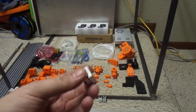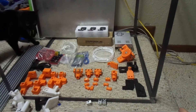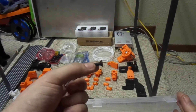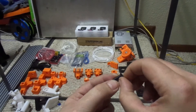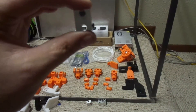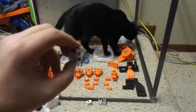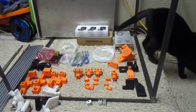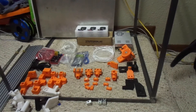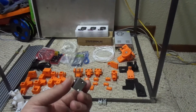For the heated plate, I'm going to try these heater blocks out first to see if they'll work. I don't know if there'll be enough power to heat it up - I tried one of them with just three lithium ion batteries in series to make about 12.4 volts, and it got hot but it didn't really heat up the plate that much. I'm thinking if I get four of them, possibly even five, just spaced out evenly, they'll actually heat up well. Maybe. If not, I did order four of the PCB heat plates that I'm using for my current printer.